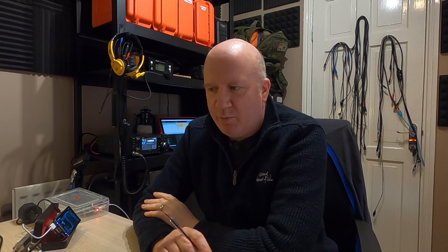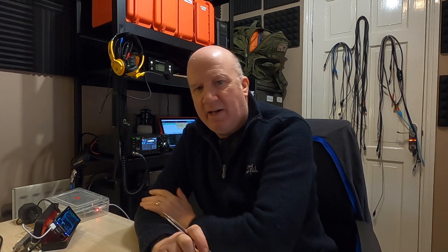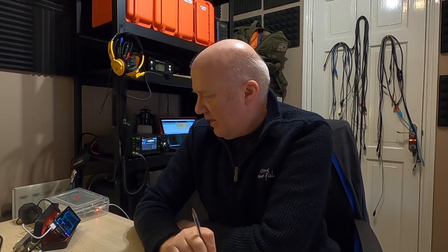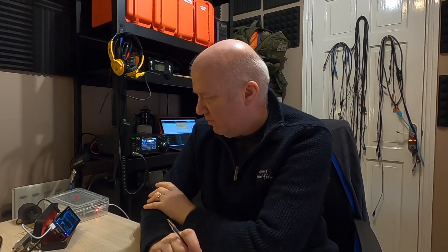The next thing I've been doing is using a slightly older Raspberry Pi with Direwolf set up on it. I've got that working with the Icom IC-9700, so I've got a temporary iGate and digi-repeater that I run when I'm sitting in here. I can't really run the APRS system and the SatNogs at the same time, because if I'm recording an observation of a satellite in the VHF band and I'm sending out APRS packets simultaneously, I'm causing mayhem to the SatNogs observation. So I just have to be careful about collisions between the two systems.